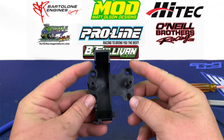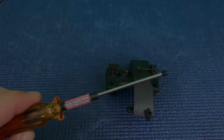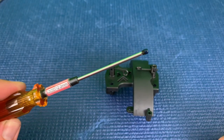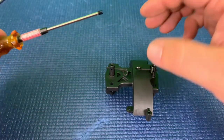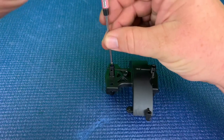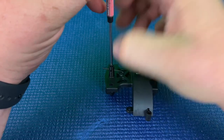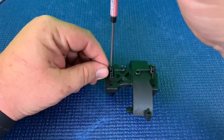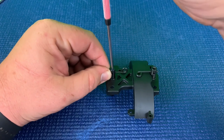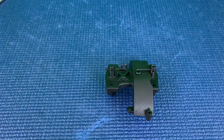Please note the orientation of the center mount and the brake cams. We will now need a two millimeter with our set screw, which is going to be the larger ones in the package, and we're going to place these right inside here. You're going to face these upright.